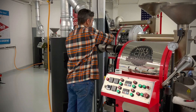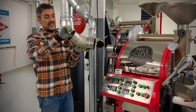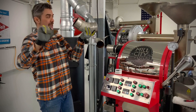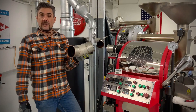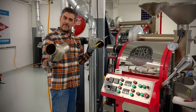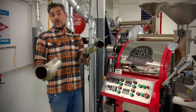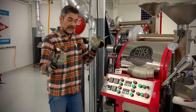I take this off and bam — right there I can look in. There's about a millimeter and a half of buildup on the inside of the duct, which is where I'd normally see it. That's where it slows — it drops sediment on the inside, moves a little faster on the outside. So I can say, okay, that's not bad. I might take my brush and clean that off. Buildup slows the air and creates more buildup, so once you see it, you'll actually get more buildup at a faster rate.